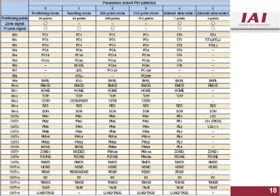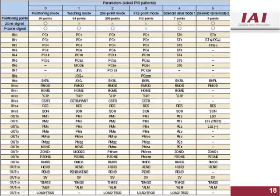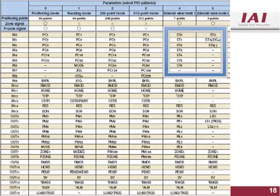The number of positions available is set by the PIO pattern, which is set in parameter number 25. This chart shows the standard Acon, Pcon, and Escon PIO patterns. PIO patterns 0 through 3 need a binary input position number and a start pulse to move to the commanded position. Patterns 0 and 1 have 64 available positions, Pattern 2 has 256 available positions, and Pattern 3 has 512 available positions. PIO patterns 4 and 5 are solenoid valve mode types, meaning there is a dedicated input for every position number. Pattern 4 has 7 available positions, and Pattern 5 has 3 available positions.